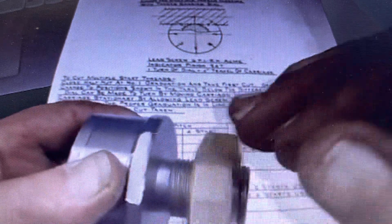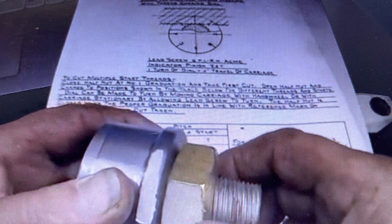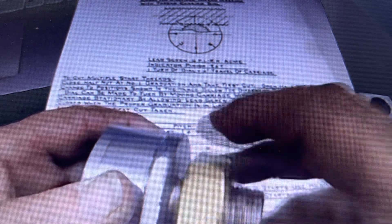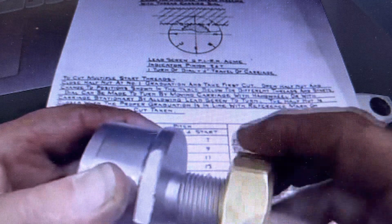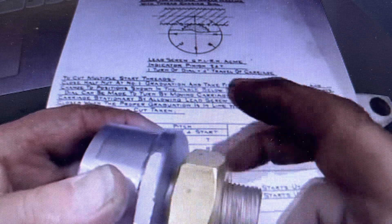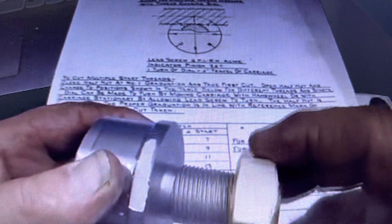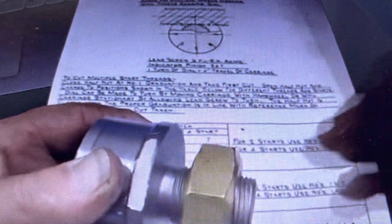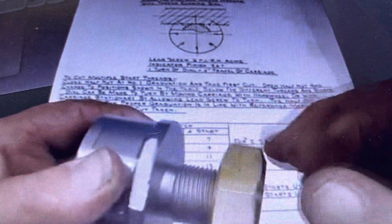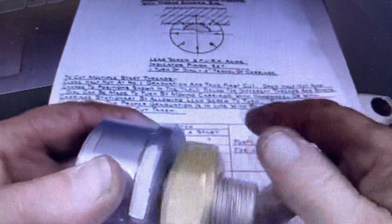So we're talking about threading four times faster. Fourteen threads per inch — we require fourteen turns. This is three and a half. Four-start threads are used for speed, and it's more important than strength.